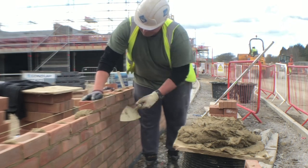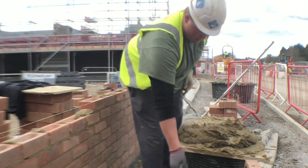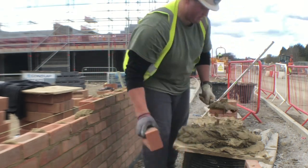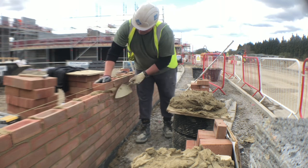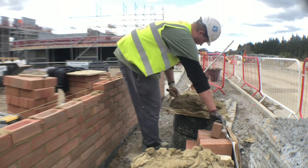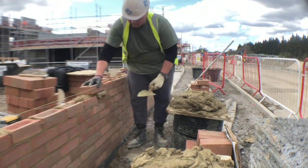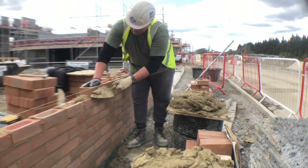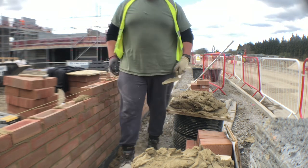In colleges you get taught to build a two-by-two brick pillar one course at a time, levelling all the way around all eight plumb points. But in effect you can just keep racking it back, and you can keep ranging down to your first course. That's one thing I don't do very often — range down to my first course. Instead of pulling the tail down and the brick, a lot of the time it's just force of habit.